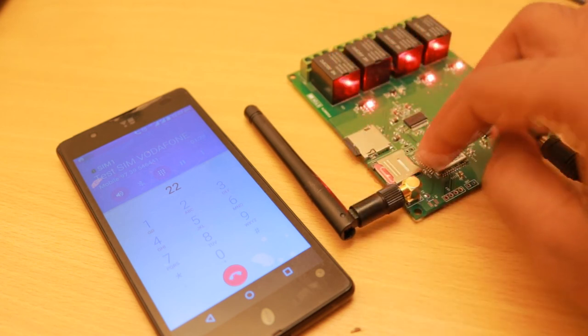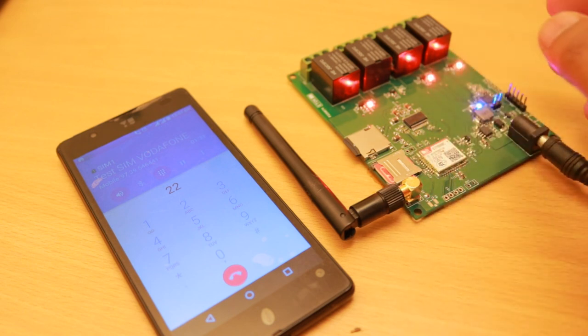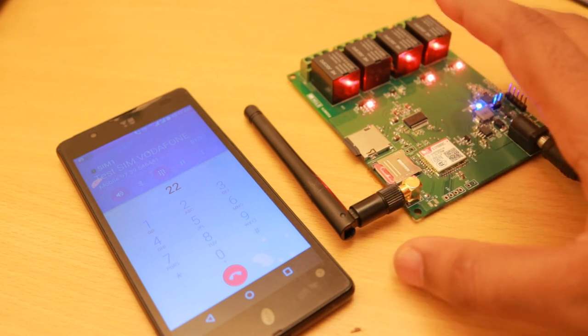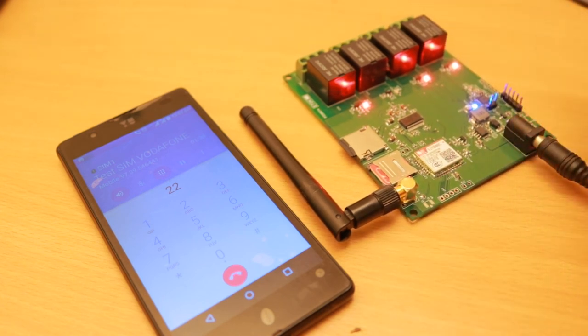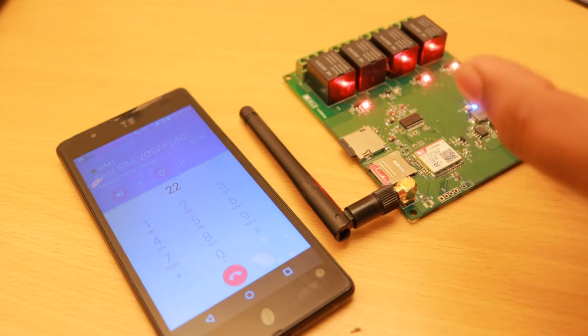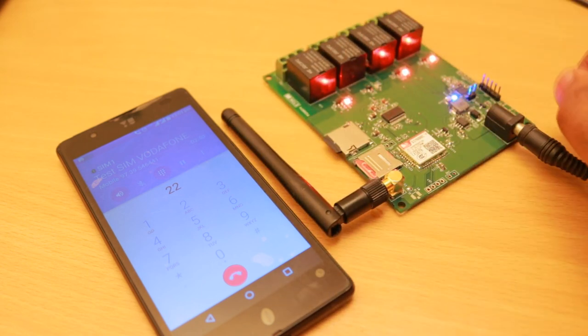We'll be adding security to answer only specific numbers. We can add one or two numbers which can control this particular board. So that's how the DTMF portion of the board works. It's quite fast and the relays can be controlled in almost real time using the DTMF tones. And we'll also be adding MQTT support for the device, and the device will be subscribed to a particular topic and it will keep watching for the messages that are published to that topic to control the four relays. So that's all for now.